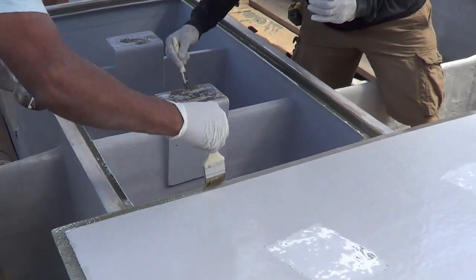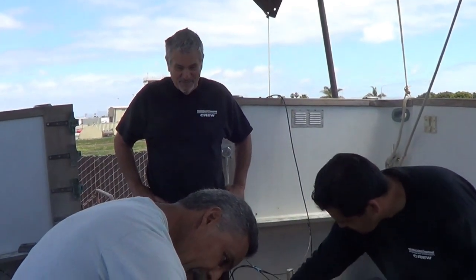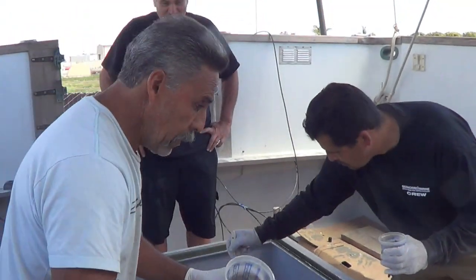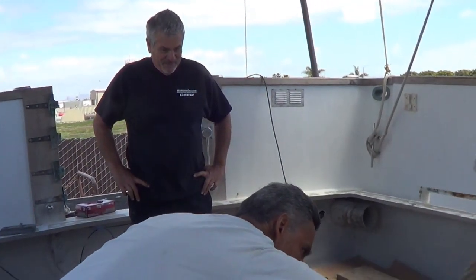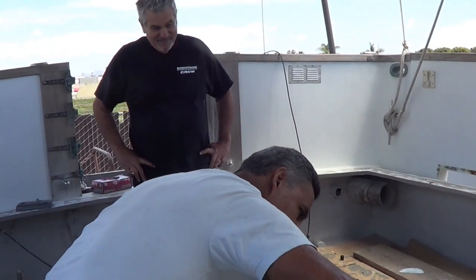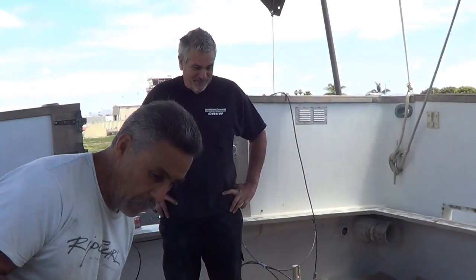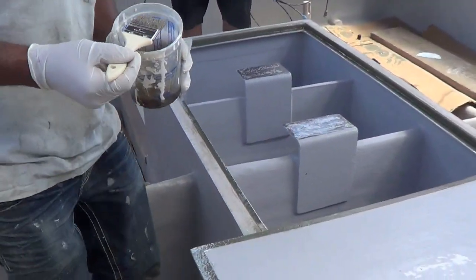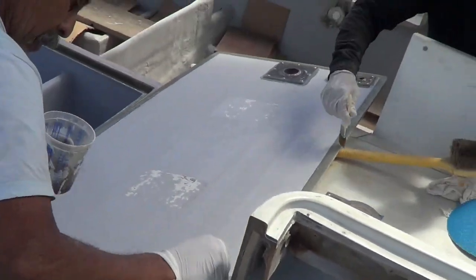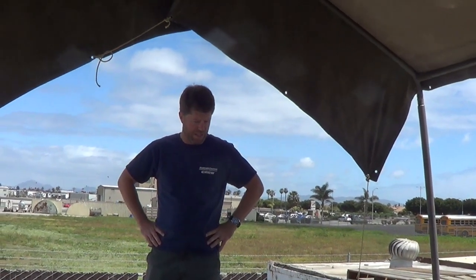It's been a lot of work to get to this point. Building internal tanks is really labor-intensive if you want to do it right. The end result is a superior product. And how hard is it to go back after you've put diesel in there and glassed everything? Especially in this case, once you put the deck on here, you're never getting back in there. You do it one time and you do it right. Unless the boat goes aground and breaks through the bottom, other than that, they're forever. Looks like we're setting the fuel tank lid onto the fuel tank with the fittings all installed and done, and we're going to glass it on.